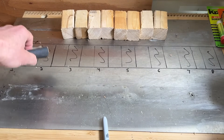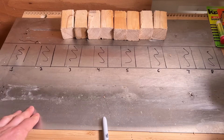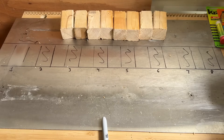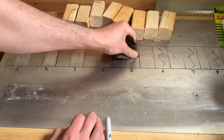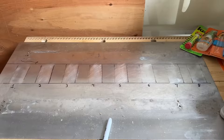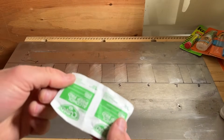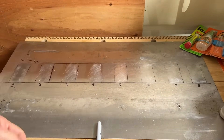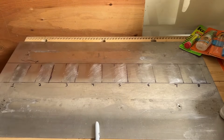Eight test zones have been plotted out on the stainless steel sheet, and each area is being sanded down equally to rough up the surface and give the glue something to grab onto — not going crazy, just a good scuffing. After that, it gets wiped down with a clean towel and cleaned with alcohol prep pads to remove any oil or residue. It was clearly a bit dirty, so we'll give it some dry time before gluing.